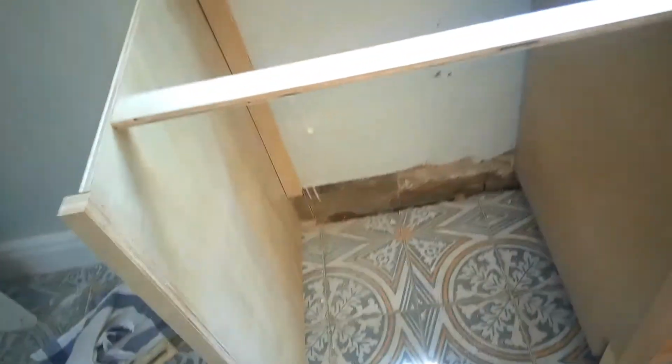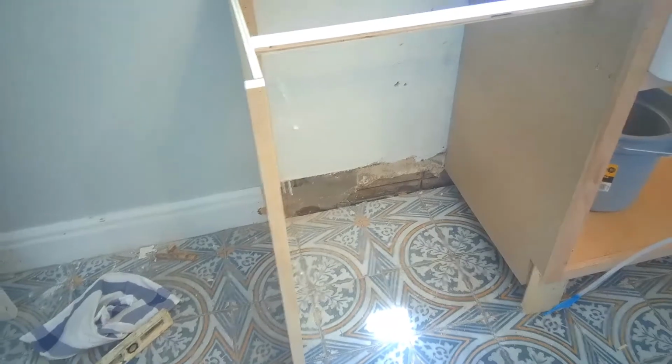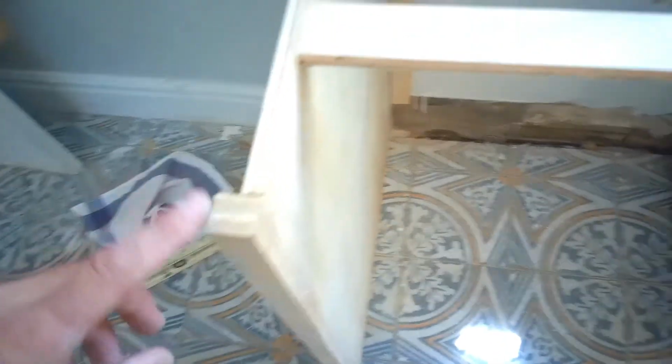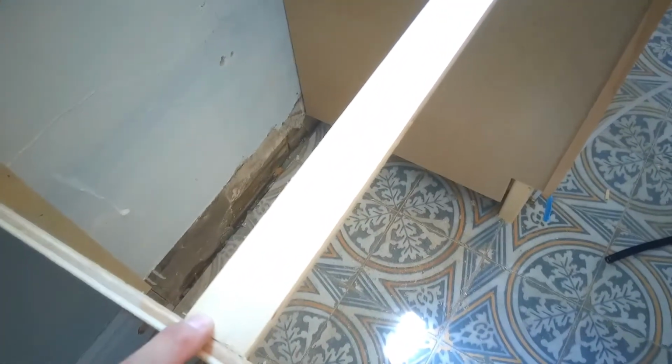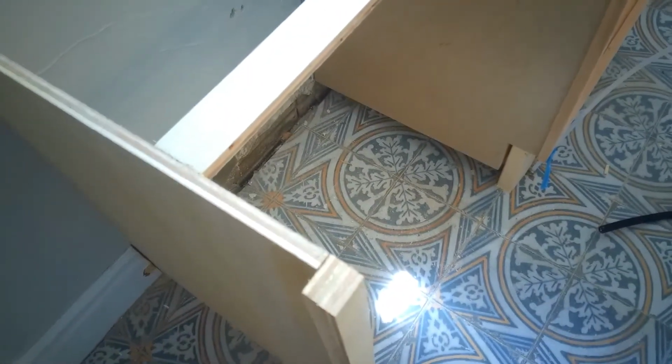All right, getting you up to speed here. So in this area is the dishwasher, 24-inch double door dishwasher. Just created a 1/2-inch end panel with 1/2-inch blonde plywood, and created a little end trim using that doubled up to create an inch. Got these at 24 1/4 because they go inside of here, just to keep the end panel stiff, and also a little extra support for the countertop. This will add some extra support for that as well.